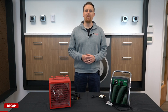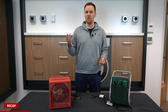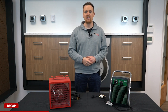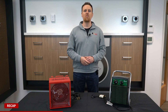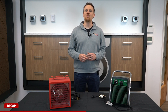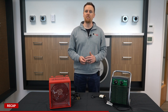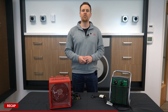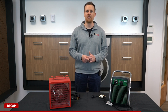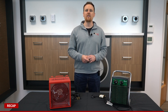The bottom line: you can't power 220 volt appliances like heaters with NEMA 6-20 or 6-30 plugs using a standard 110 volt outlet. It's not compatible and it won't work. We always like to tell people — even though an adapter is made, it does not mean that it will work for your appliances. Save yourself the frustration and potential safety hazards by using the correct power source for your 220 volt equipment. You're always able to adapt other outlets you currently have in your home, including your range outlet if you have an electric stove or even your dryer outlet.